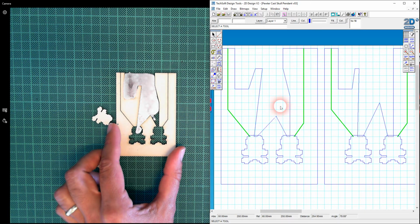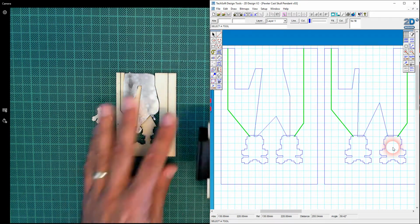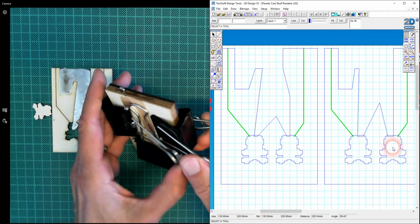I've lifted up this midpoint, so the pewter's definitely going to kind of hit here, flow down. I've made this opening into the charm wider. I think this was 2 mm, and I think I've made this 4 mm, more close to this edge here as well, and then I've also opened up this one so it's 4 mm too, the runner going into the actual charm, the cavity. So that's what I've modified, and let's just see if the results are a success.